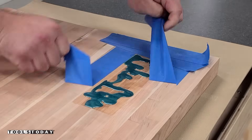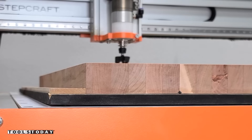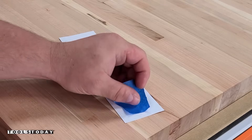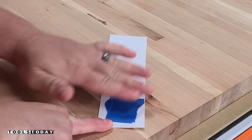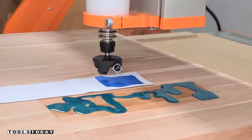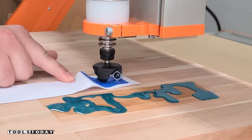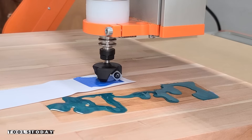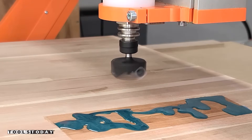We can get the tape removed that I used for the sanding sealer, and I'm going to put this back on the CNC to flatten off most of the epoxy to make the sanding process easier. I'm using a piece of paper with two pieces of painter's tape on top of it to act as an offset, so that way I'm not going to cut into the wood at all. This gives me enough height that I can sand back down but remove the majority of the epoxy without creating any divots. So I set my Z height there, and then we'll get to cutting through the epoxy.